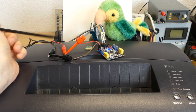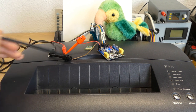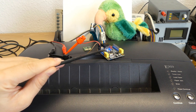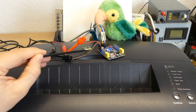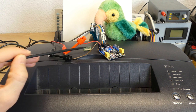They're using the chip in a quite secure way. Or are they? Well, we should check this first. So what I did here is use a microcontroller and I've programmed it to simulate this chip. This microcontroller now is a one-wire slave. We know how the protocol looks like because we wrote the protocol decoder and we have the datasheet. We know how the DS2432 works and we are pretty sure that this is a DS2432 clone or variation.